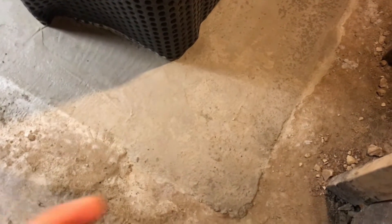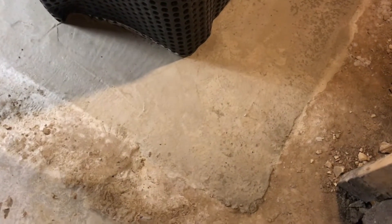We've got all the cement poured. You can see it's a little bit different color. It drains into the sump pump and it had just a couple days to dry — looks pretty good. We ended up using about 60 to 65 bags of cement, mixed with an electric cement mixer we rented. We've got about 115 feet total. In the back corner we left a small piece of pipe with a hole in it so we can access the drain tile if it plugs. We put just one sump, in the back corner.